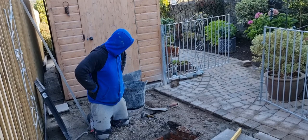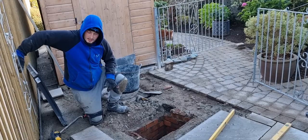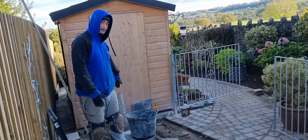One of the biggest reasons why we wanted this to be sorted, because I think you already showed him this, haven't you? That was obviously going to be left in because we weren't sure what to do with it, but now it's been changed, which is one of the big things. And obviously the manhole now, which I'm doing, is this one, lowering that down because it's too high, bed it up on a bed of compo, level it from left to right, and then that way as well, so it's got the fall. And that's pretty much it then.